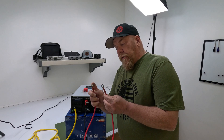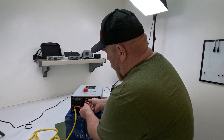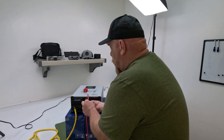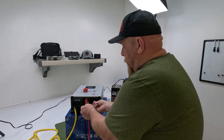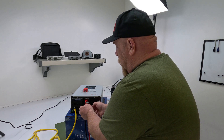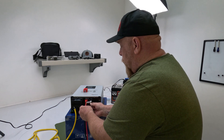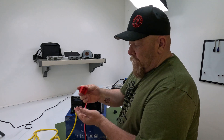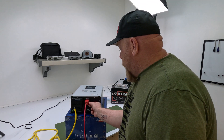On the supplied battery cables there's a smaller diameter and a larger diameter — that's for the battery, that's for the inverter. You'll also see there's a flat side and where the crimp is; it seems to fit perfectly flat side down. Then your flat washer, your lock washer, and your nut. 10-millimeter socket. You don't want to kill these, just get them snug. Then put your protective covers back on — a little plastic nut that comes with it.